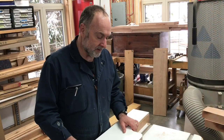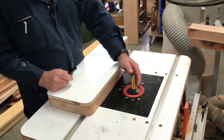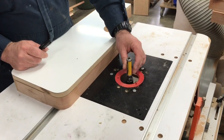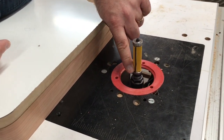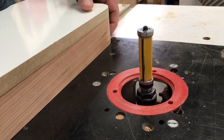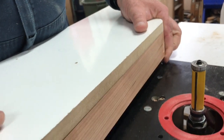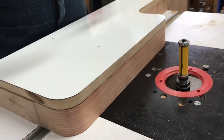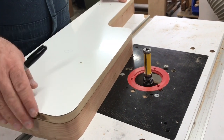Finally got that router bit that you saw. It's got the bearings on both ends of the cutters. We already had a bit like this, as you recall, but the advantage of this bit is that the cutter is wide enough to handle the thickness of material that we're dealing with. So that means we can always cut with the grain and avoid any splintering.